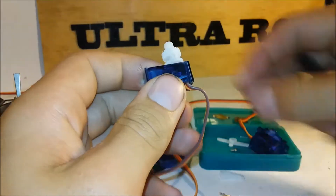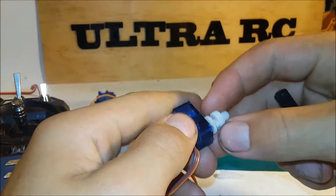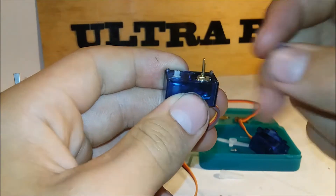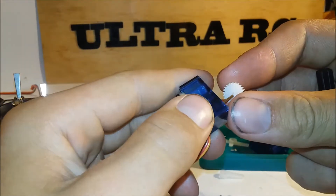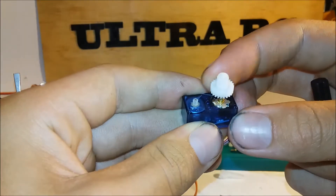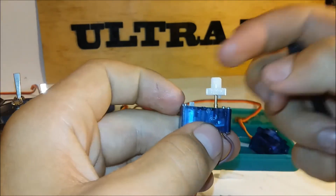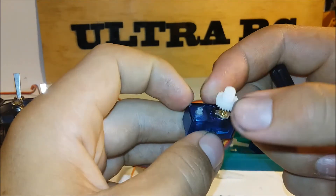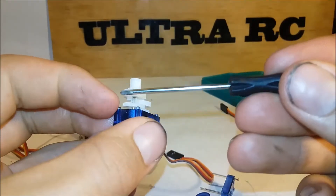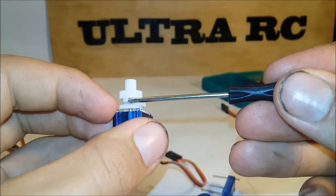Make sure that the ground's not too dirty, otherwise you'll get little bits of who knows what in the cogs. So here you can see that the potentiometer basically connects to the end of the output horn from the end there. And that turns the potentiometer on the inside. So to make it continuous, you've got to stop this from spinning and allow the output thing to keep spinning. There's a little bump just here, and that bump stops it from spinning all the way around.